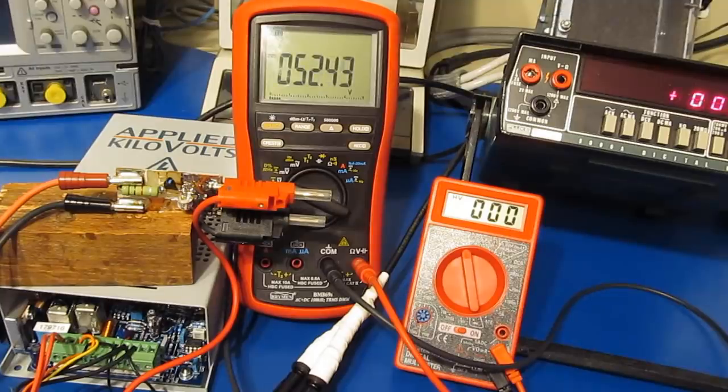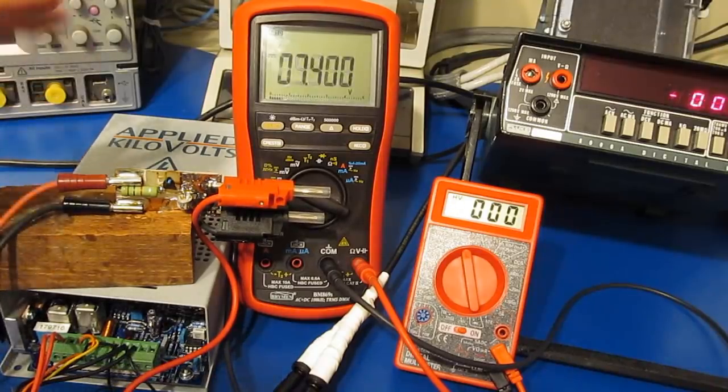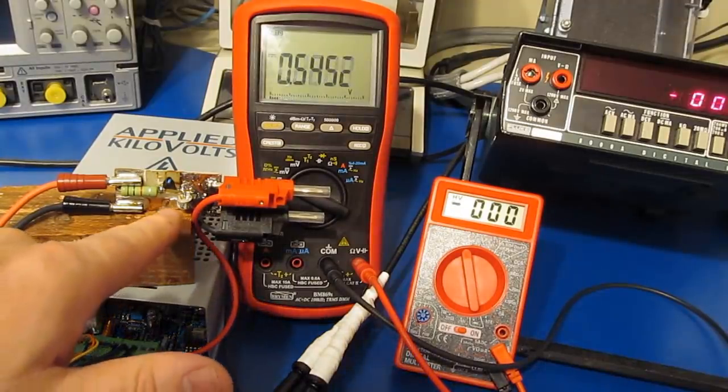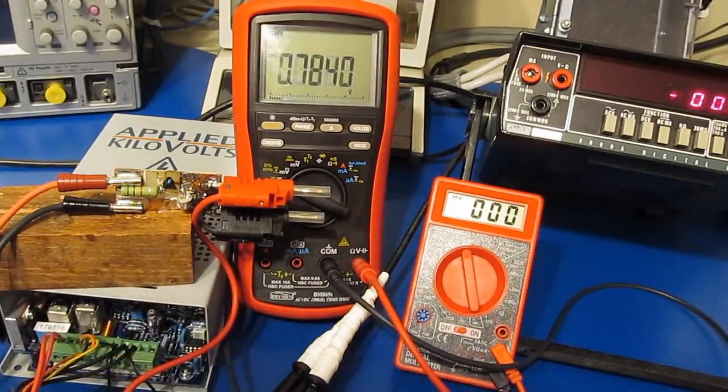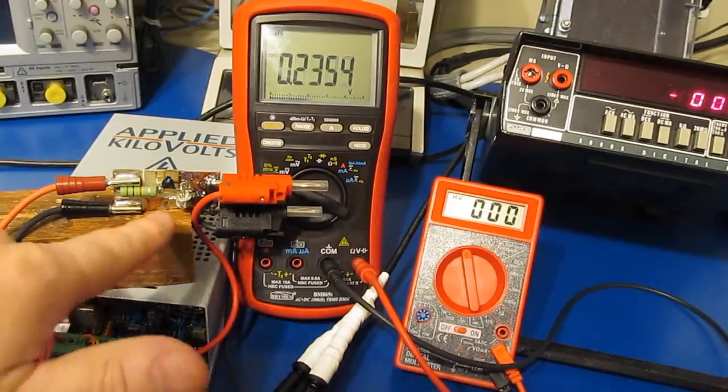Right there. Near the gas discharge tube firing. Basically for DC, until I remove the power supply, that's going to continue to fire that tube. Of course, the current is limited by the PTC and the resistor. This PTC is rated for about 1.4K. The resistor is obviously a 1K ohm resistor, so about 2.4K in series with this power supply. Of course, once the PTC begins to build heat, its resistance goes up, and that's going to limit our current.